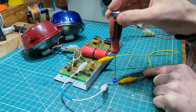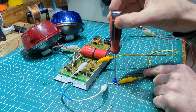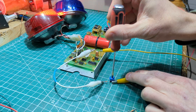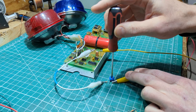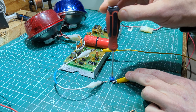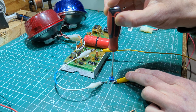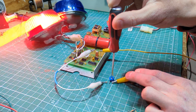With that base resistor on there, we can dial around and see what we like as far as flash rates. We could just solder this to the board and then we'd have an adjustable speed Piercer 2 power supply. Ultimately if this was a real project I'd probably do that. The next step in this particular demonstration is going to be putting this one side by side with a factory unit and seeing just how close I can dial it to the factory spec speed just by eye, which should prove to be extremely disorienting and maybe a little more difficult than you'd think. Theoretically, if I get that correct, the measured resistance on the resistor and the potentiometer after I've dialed it in should be around 19k.